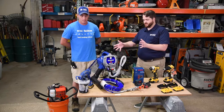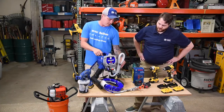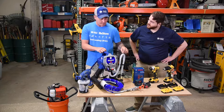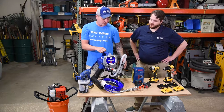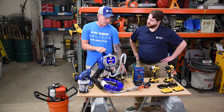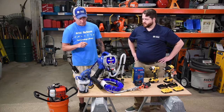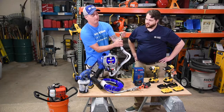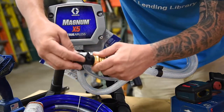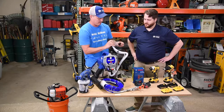What is this? This is imposing. This is Graco's Magnum — it's an airless paint sprayer. It has the ability to run out of a one-gallon or a five-gallon pail. The thing I love about this is the hoses are actually see-through. It's very user-friendly in that when you prime this, you can see that paint go through into the motor and then back out, so you know it's fully primed. You won't have air pockets or bubbles or anything that's going to affect your spray. Also, this filter here comes off, and you can connect your garden hose to it to clean it out, and you can see visually that it's cleaned out.